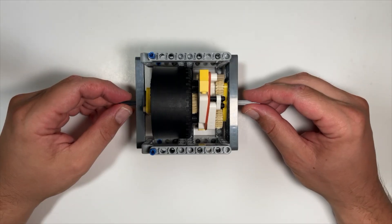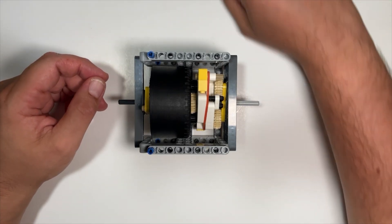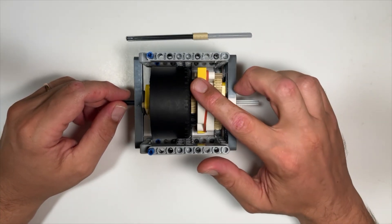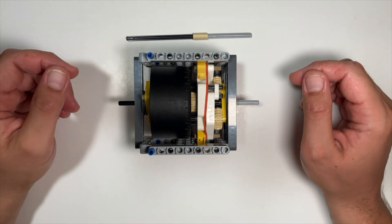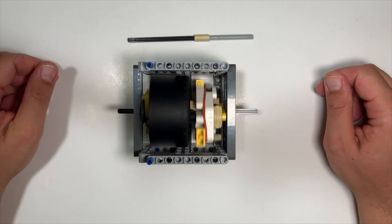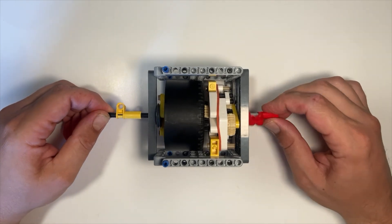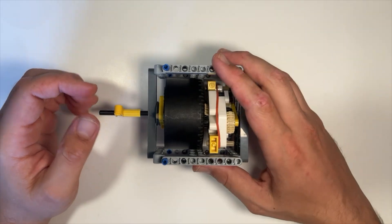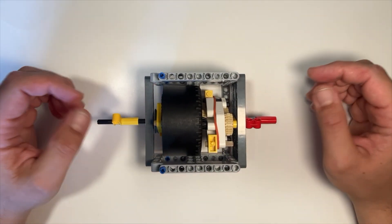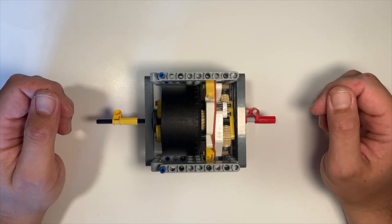Now let's talk about the efficiency of this mechanism — this is the most exciting part to me. At the maximum gear ratio, I just love the fact that this transmission functions as a single axle, and that the ratchet mechanisms are completely neutralized. This means the transmission is essentially 100% efficient at its maximum gear ratio. At the minimum gear ratio, with the spindle being stopped by the ratchets and the clutch shoes pulled away from the drum, the only efficiency loss is due to having two planetary gear sets for symmetry instead of just one — but this means efficiency is still around 99%.